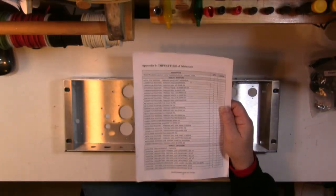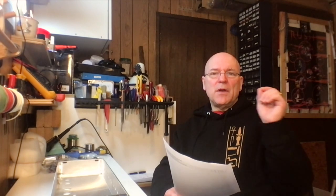So Trinity Amps has been really good with their documentation. They provide the documentation, including the bill of materials and everything that you need. And I've just gone through this, and there were a couple of things that were missing. It's not a big deal. I have those pieces in my own stock in these cabinets up here. So in my case, it was missing two of the 4 1-meg-ohm resistors. Those are a really common part in amp building. They're most common in the initial input stage of your tube amp, and I have a bunch of those,